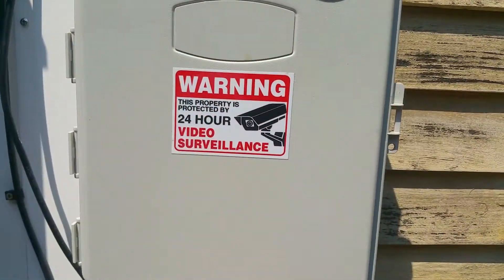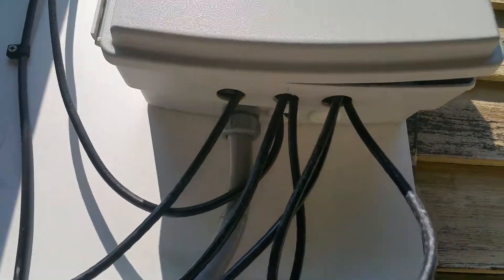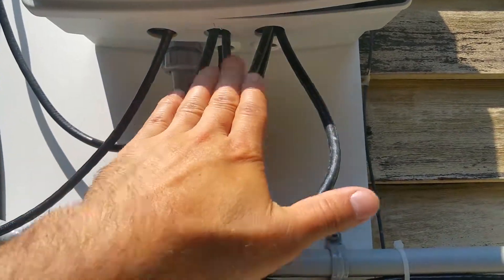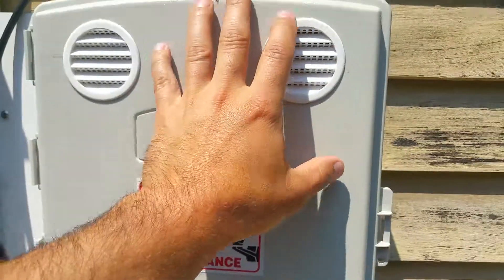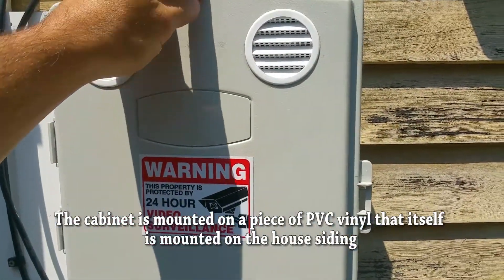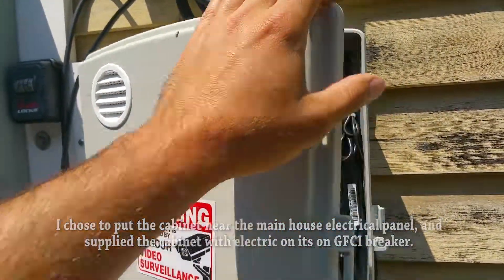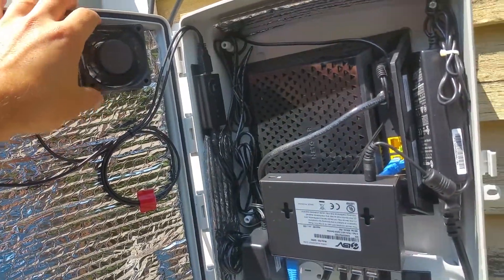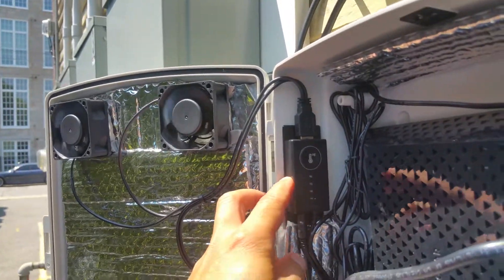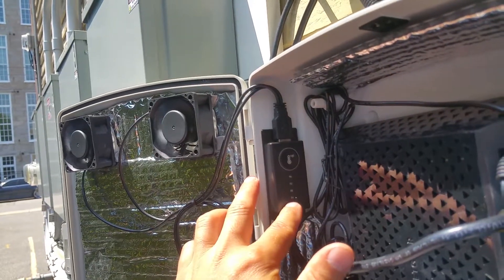One important thing: normally you want one intake at the bottom and the exhaust at the top. Instead of cutting an additional intake hole, I used the existing holes at the bottom to feed air in, hoping the wind pushes air up and the exhaust fans push the hot air out — and that ended up working. The insulation was added after I bought the cabinet; it didn't come with it. But what really seemed to do the trick were these fans, controlled by the AC Infinity thermal controller.